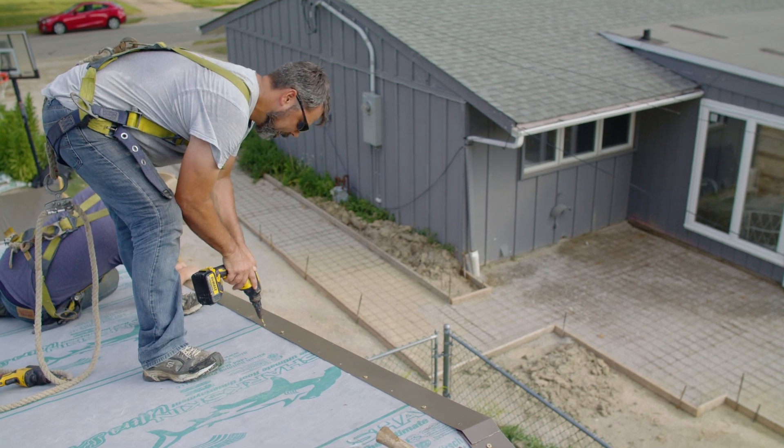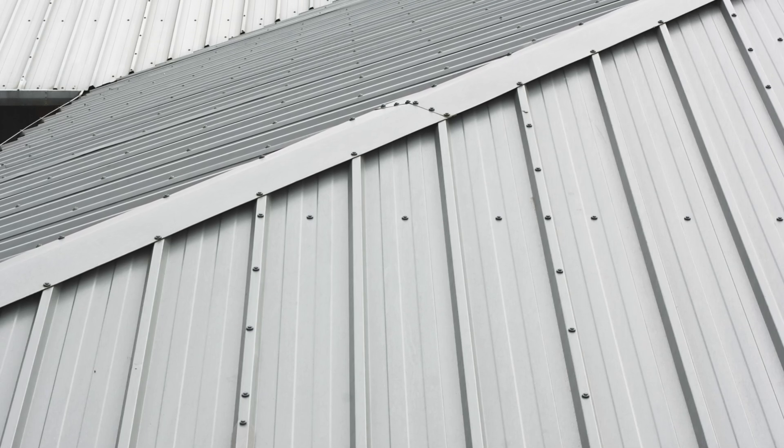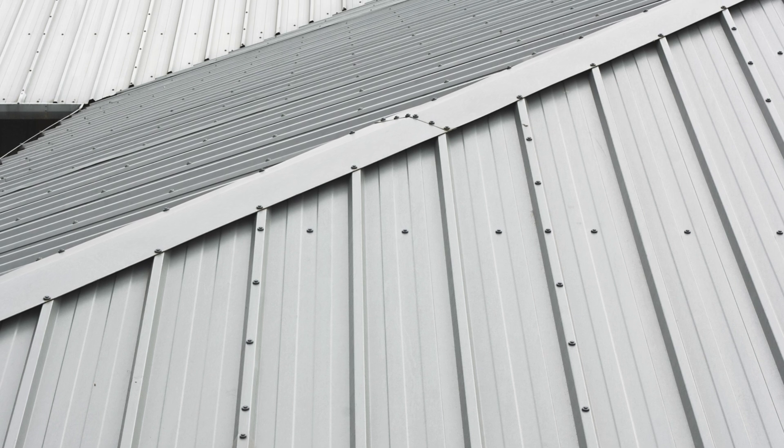There are two different ways you can go. If you're putting a metal roof on your home, you can buy a metal roof package — say you're going to put a classic rib panel or an agricultural panel down. A lot of times you can buy that panel and get a brochure with a bunch of standard details. You'll measure your house and purchase what they make as a standard detail: a ridge flashing, rake flashings, and you'll use that system. Hopefully those pieces work for you.